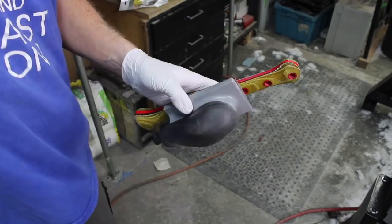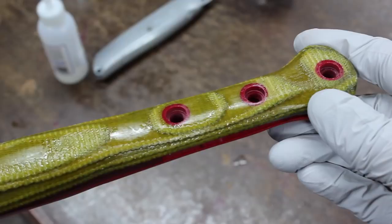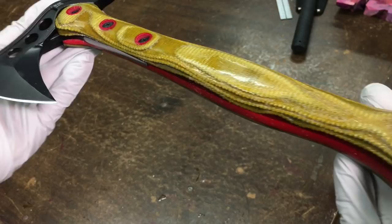To finish it, I didn't want to put a big finish on it — didn't want to spray lacquer it with a bunch of coats. It's basically epoxy and fire hose, so it's going to handle the elements and use just fine. It doesn't really need a lot of finish. Plus, if you put a big glossy finish on it, you might have problems with it being too slippery. So I wanted to leave it mostly as it was, but I did put a couple of coats of thin CA, just wiped it on. What that did was let you really see through the epoxy and see the depth, even with some sanding marks left. It worked out pretty good — just a couple of wipe-on coats of CA and this thing is done.